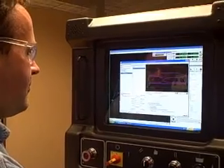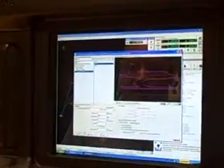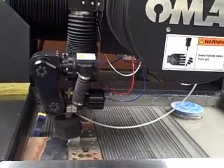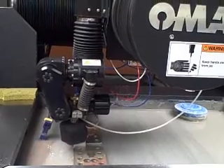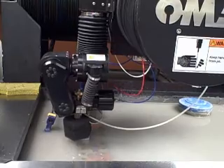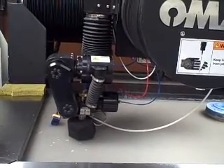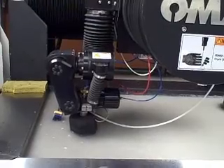I need to change this so that we have the second path loaded. Being that this aluminum is the same thickness as before, we can go ahead and leave it at two inches and just about leave everything alone. So I'll click OK to this, and that's it — we're basically ready for cutting. We have the second pattern loaded, so I'm going to go ahead and raise the water level to prevent any splash and extra noise. And here we go with the second path.